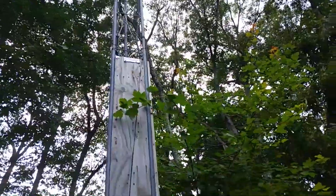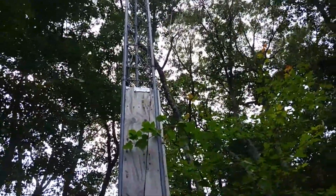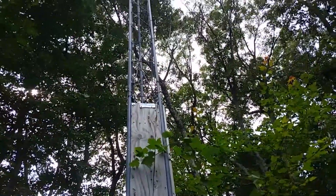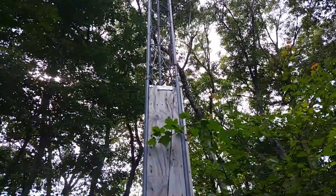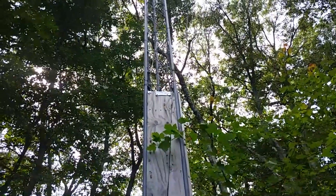What you should have is a copper lightning rod that extends several feet above your highest communications device. That lightning rod creates a sort of umbrella over the tower so that any lightning coming close by will actually hit the lightning rod. But it's no good to have just a lightning rod — you need a fairly heavy copper wire from that lightning rod coming down to your grounds. That copper wire should be what's called bonded, or in the industry, cad welded.